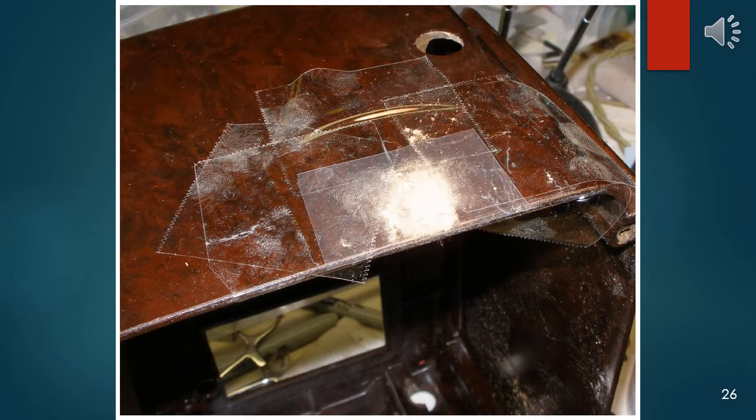Filling the top side of the crack is difficult when you have a swirled coloration in the Bakelite. I'm not going to get perfect results. I usually look for a damaged Bakelite knob in my junk box. Using a dull file, I make a little pile of Bakelite dust. I can then pack the dust into chips along the edge of a crack and very carefully use the pipette to apply a tiny bit of the CA adhesive.